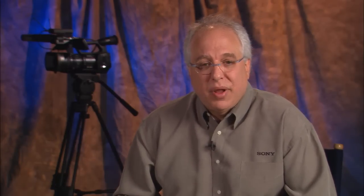We also offer tone squelch circuitry, which prevents popping when turning the transmitter on or off, and also prevents unwanted transmissions from making their way into and out through the receiver units. Another useful feature is a battery countdown timer, so that when you put in a new set of batteries and zero out the counter, you can see how many hours the batteries have been used for. If you can expect about eight hours of battery life and you've only used two hours in your last session but only need three hours today, go ahead and save the money of putting in new batteries. Finally, we put a headphone output on our portable tuners in addition to the audio outputs. If you're monitoring with headphones through the camera and hear something wrong, you can't be sure if the problem is in the wireless or in the camera. But with a headphone out on the tuner, you can check the signal between the transmitter and the tuner and confirm that it's clean, helping you diagnose the problem.